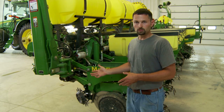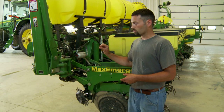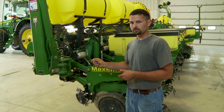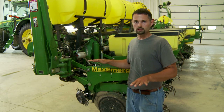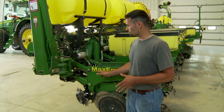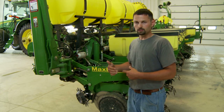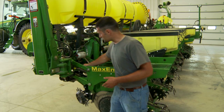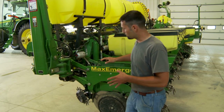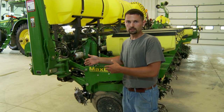This year we kept the adjustability from the cab and we actually added hydraulic down pressure. What I've seen from that is the hydraulic down pressure has been a lot faster than the pneumatic and a lot more even across the entire planter. One of the nicest things about this row cleaner — I think one of the reasons why it doesn't wrap and doesn't plug like the old style — is that it's floating and it'll go up and come down, but as I'm going through the field I'm pulling the unit instead of pushing it.